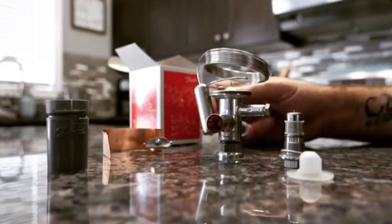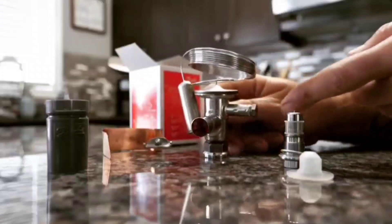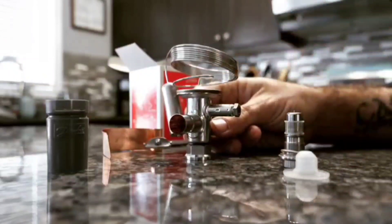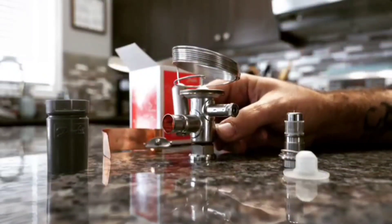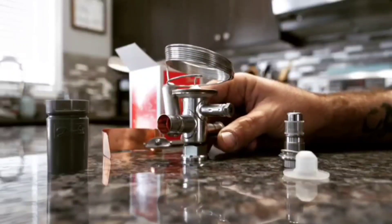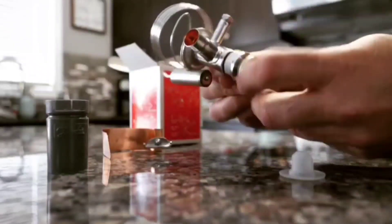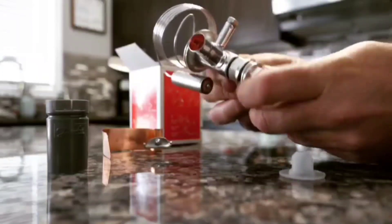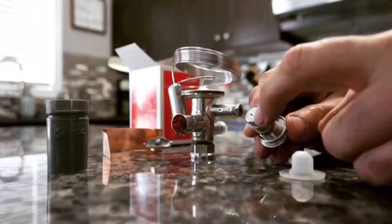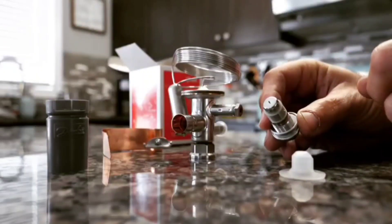All right guys, just a quick video in my kitchen. This is a Danfoss TUA stainless steel TX valve — stainless steel on the outside, but there's copper on the inside. So you can actually use 15% Sil-Phos when brazing this, and you don't have to wrap it because stainless steel conducts heat 11 times slower than copper. What's cool about this valve is it comes with an orifice that you can change out, just by popping it in just like that. The instructions state that you add a drop of oil to this pin — whatever the system is using, POE or mineral oil, that's what I would use.